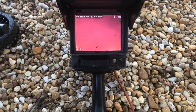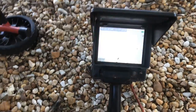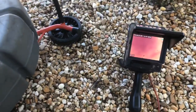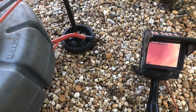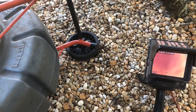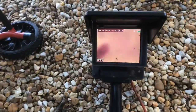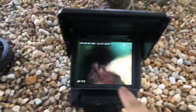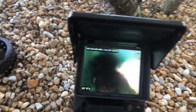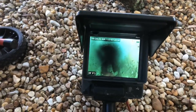And if this is a problem that cannot be fixed immediately, which usually it cannot be, I want you to know that single ply paper and body waste only, or you're gonna plug right back up. Oh, that's single Scott's ply? Single ply. It's got to break into a billion pieces if it gets wet. You'll know the difference. And the reason I'm telling you that is I will likely tell you, see this? See that? Yeah. So what I just did is push the paper through the blockage.